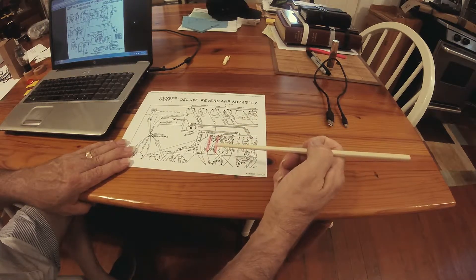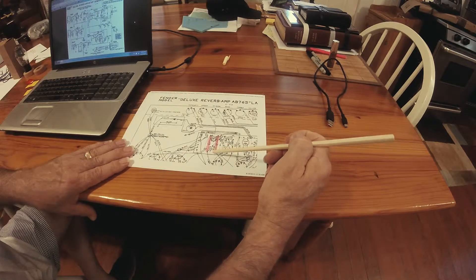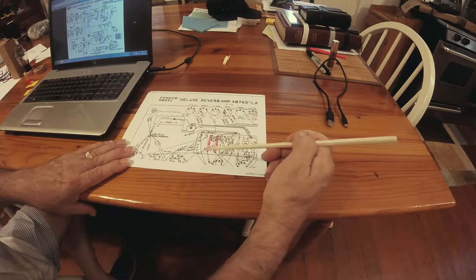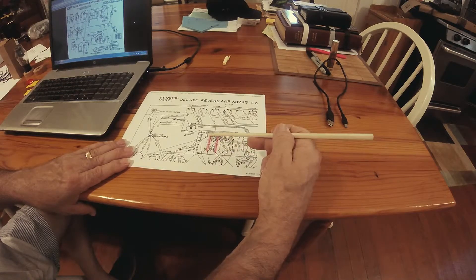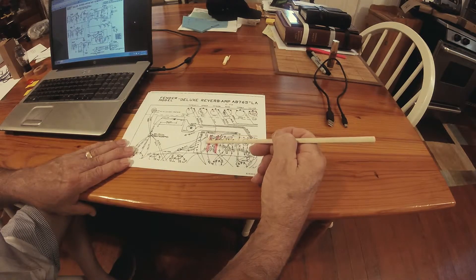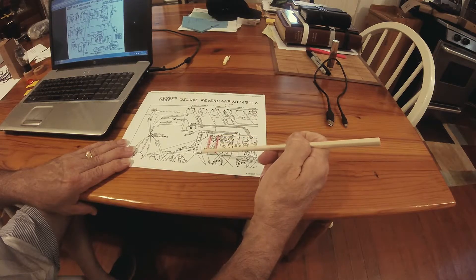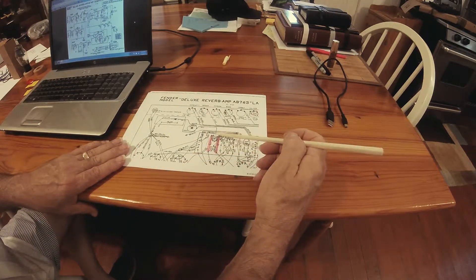Get your replacement capacitors — lately I've been into paper and oil, and they're pretty nice. Put in a 0.047 in this position. I usually tin my capacitors before I put them in, and bend them to size. Reinstall them in the same place. Make sure the resistors are solidly in place. There will be a wire coming out of this side that goes to the grid of the output tubes, and the one on this side — see that dotted line there — it goes to the grid of the second tube. Make sure those are still soldered in place.